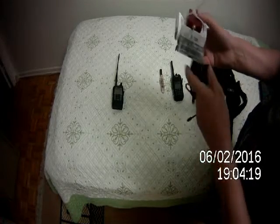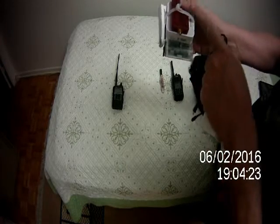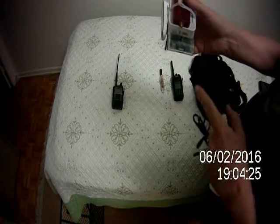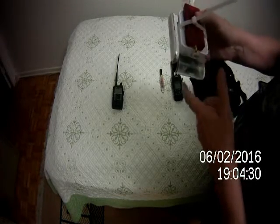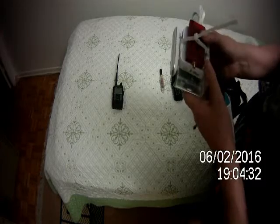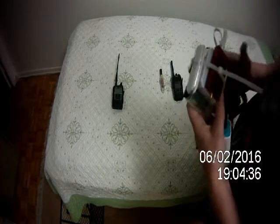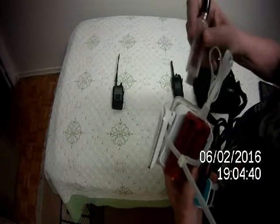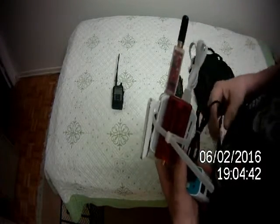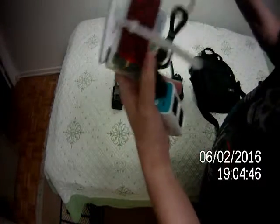So let's assume I've unpacked everything. First thing I do is take my USB cables — one USB micro, which goes in the 2-amp side, and one USB mini, which goes in the 1-amp side. Running the DVAP and the tablet was very power intensive, although it did give me at least two hours with the little battery. This would power it all day. To recap: Raspberry Pi, 4G router, 4G stick, DVAP — which I'm not using for the demonstration, but it's there so you can see I can use either. The DVAP, of course, only does DSTAR. So we take the DV4 Mini dongle and plug it into one of the USB ports, then power up the router.